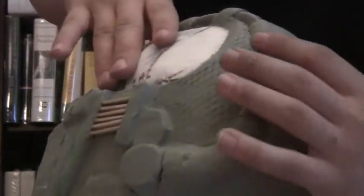This part over here has a texture — I did that by taking some kind of metal grate with a similar pattern and pressing really hard against it. It came out good at first, but making the mother mold for the front I messed up twice and had to re-sculpt it, so it looks a little faded. You should know how to sculpt when you're doing this.